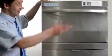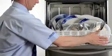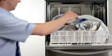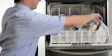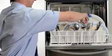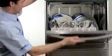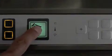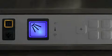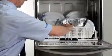This is how we load the machine. Load the machine sensibly and do not overlap the items. Make sure you separate the plates and also keep the cutlery in an upright position with the handles facing down. Once this has been done, slide the basket in and start the washing process. Press the main program button — it will turn blue. When the wash program has finished, the button will turn from blue to green. Once the program cycle has finished, remove the wash items and repeat.